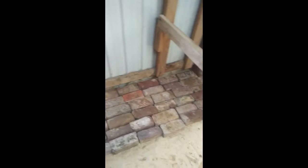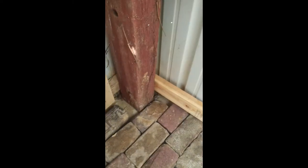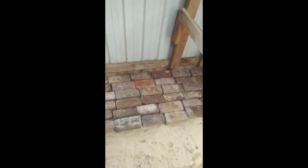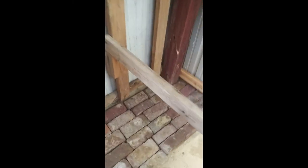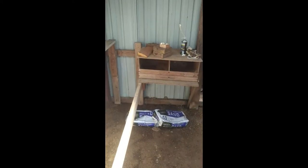This is the work of a couple bags of sand — we need about half an inch deep. Each half-cubic-foot bag of sand covers about 12 square feet, so six bags for the whole floor and two more for between the bricks. Here's a progress shot with several rows of bricks down. I'll need to put some rubble and bits in along the cracks and edges, and I haven't put sand in the cracks yet, but I've got lots of concrete rubble from other piles I can throw in there. I definitely have to watch my head walking in here — towards the back of the coop I tend to smack my head.